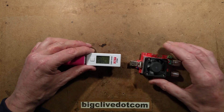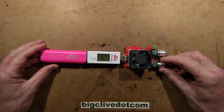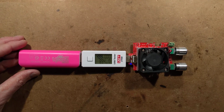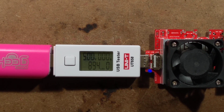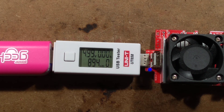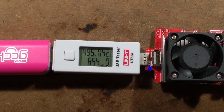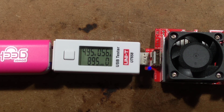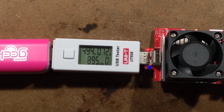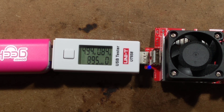So let's get this tester — a generic eBay tester — and let's crank this up. Let's zoom in so you can see what we're getting here. Tweak this up: 200 milliamps, 360 milliamps, it's holding at 4.95 volts. 560 milliamps, 660, 720 milliamps — it's down to 4.92, which is still acceptable.